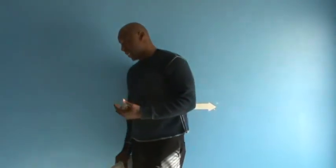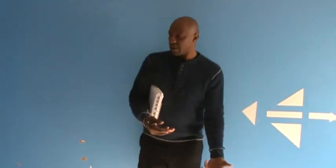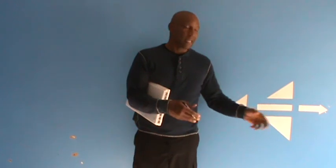How serious is something like that, a crack like that? The hard part is if you're on the end unit. If this house were on the end, I'd have more concern, because typically a crack like this would show that the underpinning is probably giving out. When they first start building from the ground up, they have to put extra concrete and stuff under the ground to support what the house is sitting on. If it were an end unit in the townhome and we saw that, I'd have concerns about structural issues. But because it's between two other houses, it's probably just settling, and it's never been repaired.